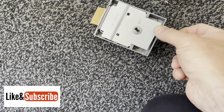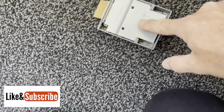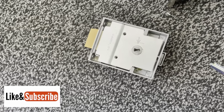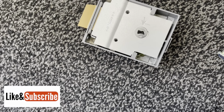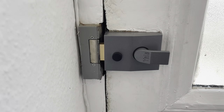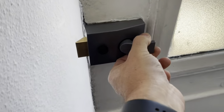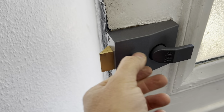So just get this back on, and obviously making sure that the arrows are not lining up, because we don't want them to be able to deadlock it from the outside. Another fire hazard, obviously, people won't be able to get out. And then we can get this one fitted. Right, there we go. So new night latch on there. Snib's disabled, doesn't do a thing. So I've taken that bar out from the side.